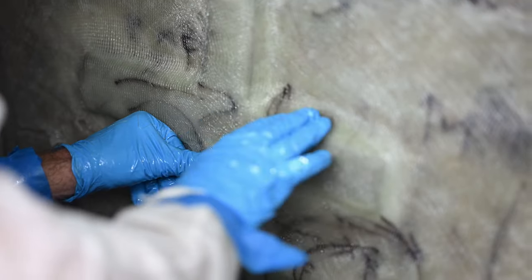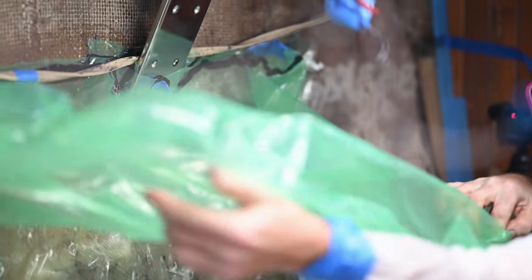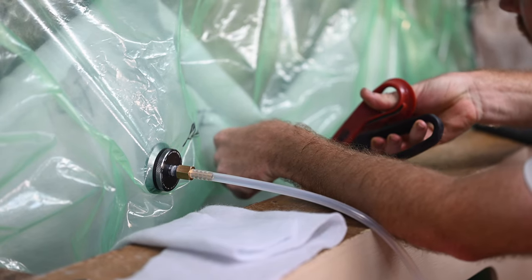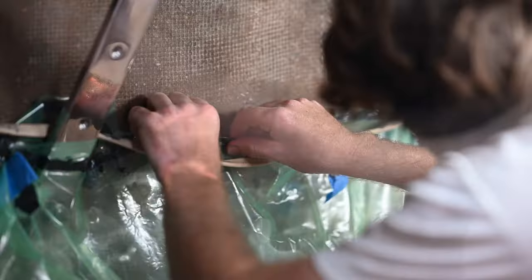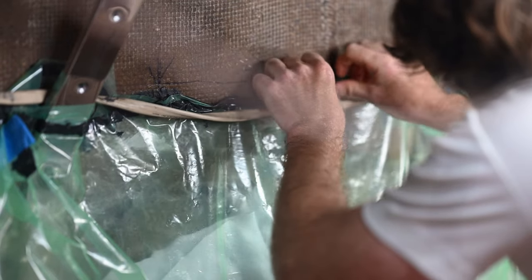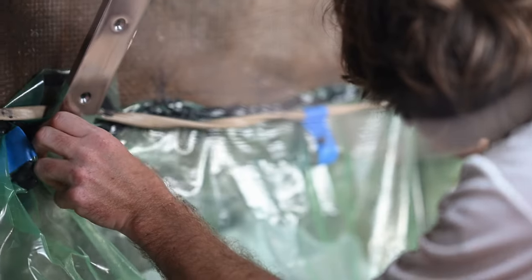I hope not. So the most important thing to do with an epoxy layup is to get all the air bubbles out. Here I am using a roller to press out air bubbles. Looking pretty good here with the vacuum bag butyl taped up at the top, and peel ply is on and cutting out the breather. Now I'm putting in the ports, which I forgot to do before butyl taping the vacuum bag all the way down. So having to reach over the top and now redoing the butyl tape up at the top and trying to press everything down so that we have a good seal. I couldn't quite get the breather to go where I wanted it, but it worked well.